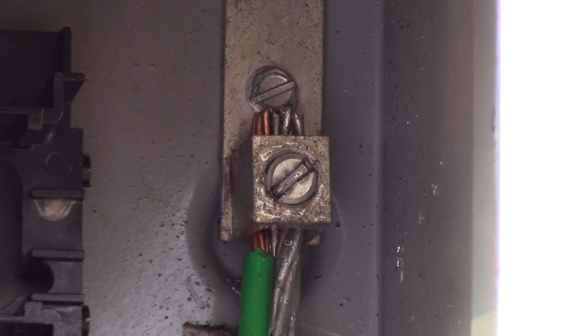I've found another screw for that grounding lug. I've put my grounding conductor — the green one connected to the ground rod — along with the neutral from the triplex underneath that lug and tightened it down securely. Now I can take my meter and do some testing after turning the breaker on to make sure that all is well.